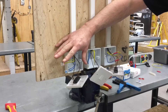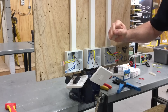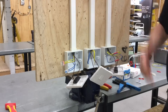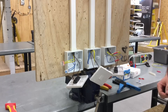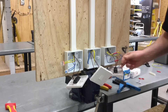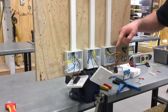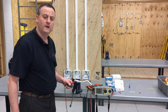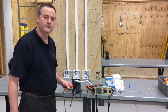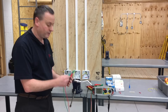So we've now got our crimp connections. To summarise: maintenance-free style Insure and Wago, five amp connector blocks, and through crimps - three differing methods to join together our two neutrals and two CPCs in each of our lighting switching points where we've had a feed drop down. We've dropped down line, neutral and CPC and come out from the switch with a switching line, neutral and CPC. The switches themselves are fully insulated so don't need to be connected to the CPC at this stage. Now let's see how we're going to make a continuity of CPC test at the switch.